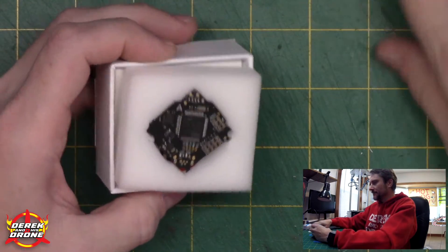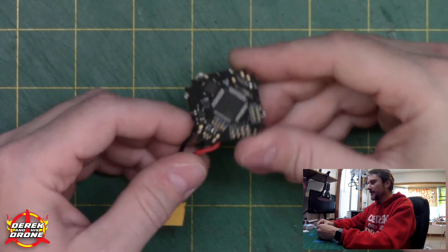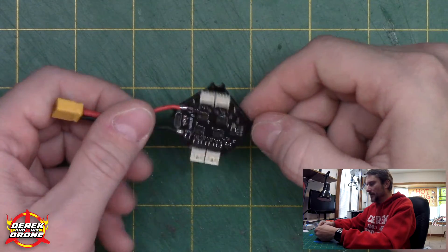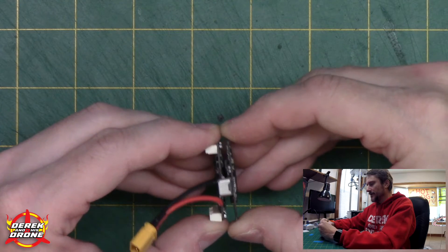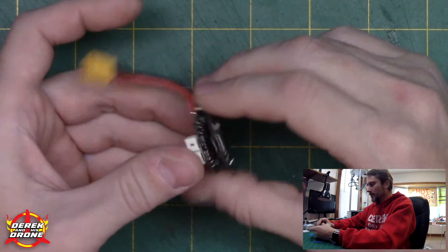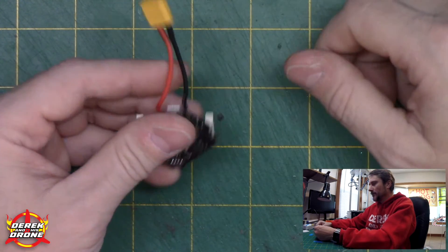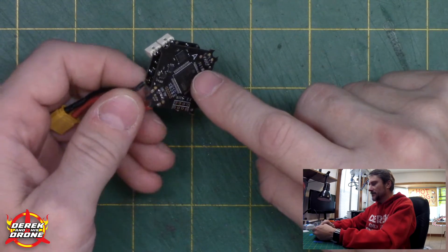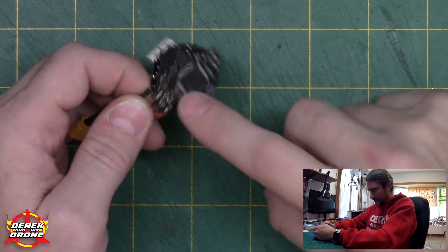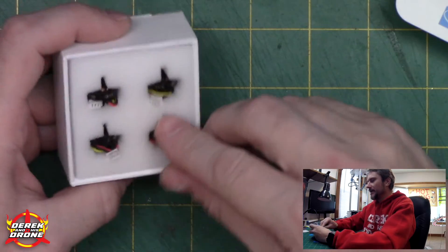Let's take a quick peek at the flight controller. Again, BetaFPV — that's where most of this gear is coming from. This is their new 2S brushless flight controller and ESC. It's an all-in-one combo unit, but it is possible to separate them with a little wiggle. It comes stock with an XT30 cable. It has an F4 processor, full UART, Smart Audio, OSD — this thing's got all the bells and whistles. Got to have OSD on long range — got to keep an eye on the batteries.